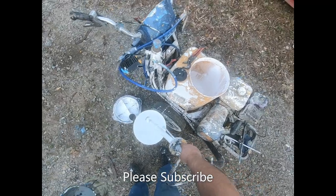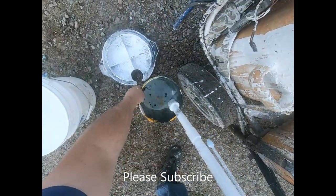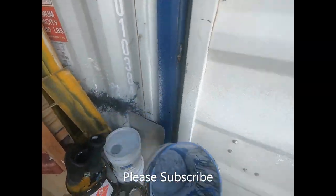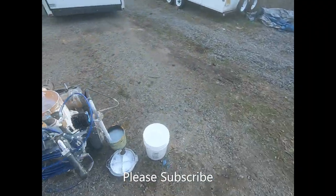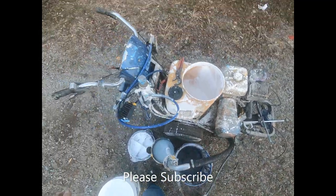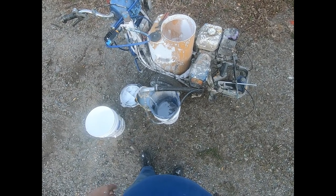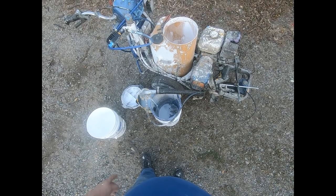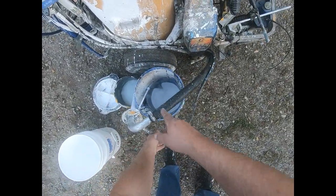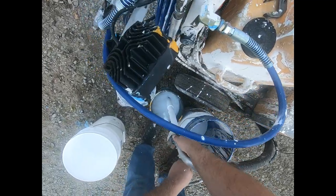Since this is going to be a winter flush — normally this is how I'd leave it during the summer if I was just cleaning it between jobs — we're going to take it further. To keep the water as clean as possible, we take the suction and the primer tube, put it into a different bucket until it starts running clean water. It takes a couple minutes. Right now you can see on the side of the bucket, it's clean water coming out. So we turn the pump off and put it back into the clean water.